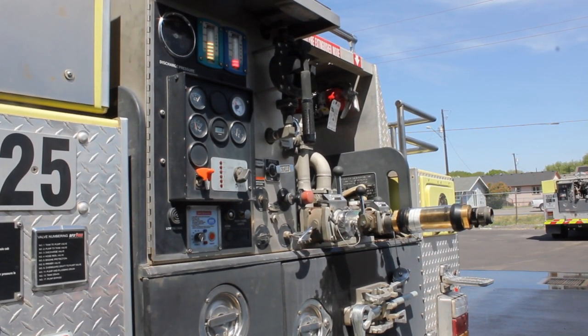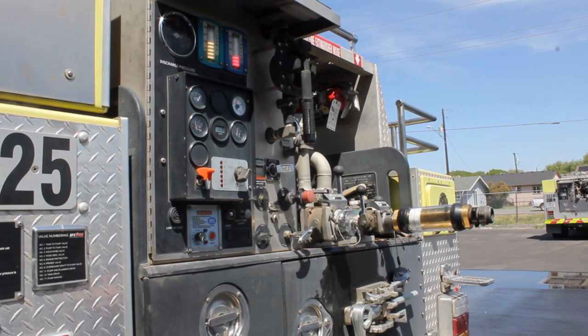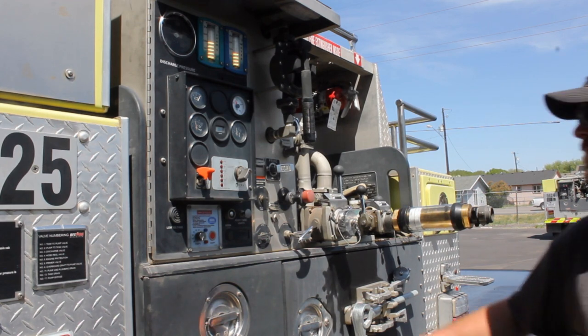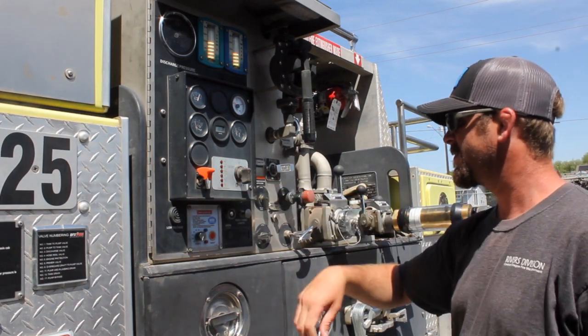The interesting thing, which demonstrates the point of this pump type, is that best flow at free flow, that's where we left it flowing unrestricted and we RPM down slowly. You saw how it came up, we actually had 126 at much lower RPMs. So on these Darley AGEs, or at least this one specifically, you can get more volume when you're under a heavy volume load. It actually performs better at a slightly lower RPM. I don't know why it does it. It's just an engineering thing. It's the way it works. You can probably shut that off now.